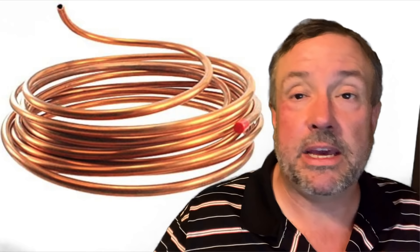If the sand thermal battery is operating at two to three hundred degrees Celsius, I think there needs to be a secondary thermal exchanger — essentially a mini battery most likely made of water in the two to four hundred gallon range, which is more affordable and more readily available in insulated metal. That water system would then go to the house or greenhouse for heating. Sending two to three hundred degree liquid directly into your house could be dangerous, so I'm thinking we need a two-stage system.